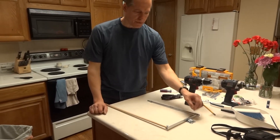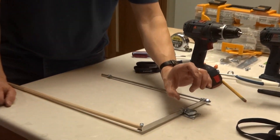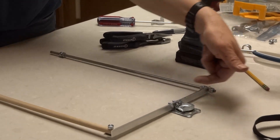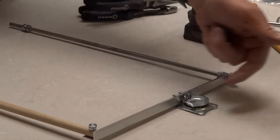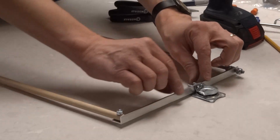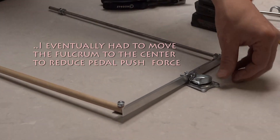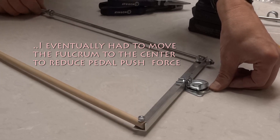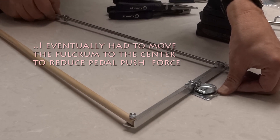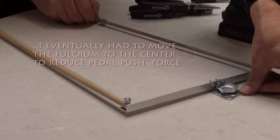This was the swivel that used to have the swivel wheel on it. I used a metal cutoff wheel to take off the wheel, then drilled holes in it and attached this aluminum angle piece here. We've measured it and we're getting about a two-inch throw on this side and about a three-inch throw on the other side.